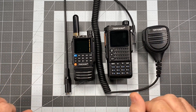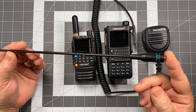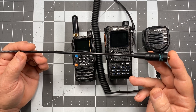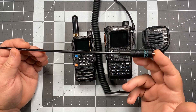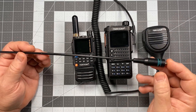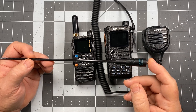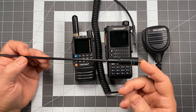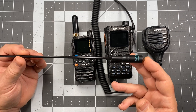The results I got: when I keyed down on VHF on two meter, the needle barely moved — which is excellent, almost a perfect impedance match, which surprised me given the cost of the antenna. When I moved to UHF it went up just a little bit, to about 1.3, which is normal when you move from one band to another on a dual band antenna. I should also report I was testing on high power — a full 10 watts — because SWR readings will also change depending on the output power. On GMRS, about the same as 70 centimeter, right within the same ballpark. SWR was good.